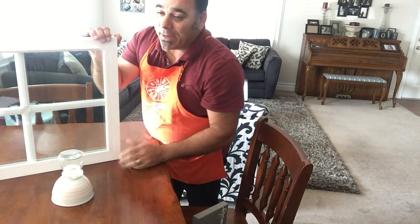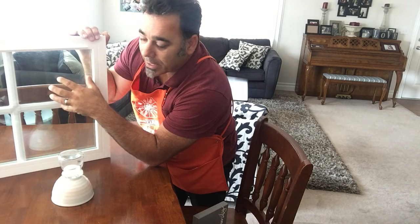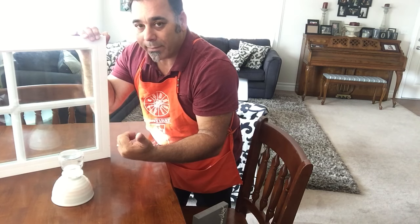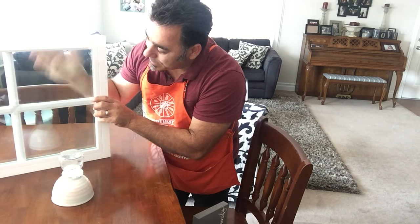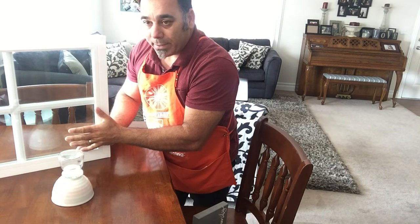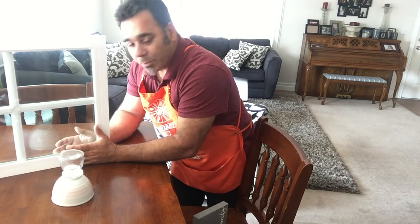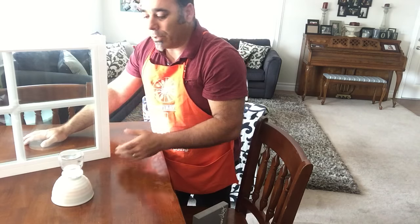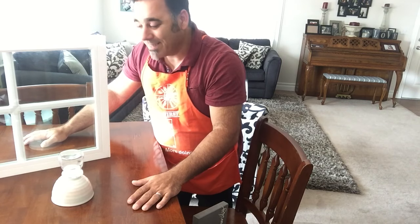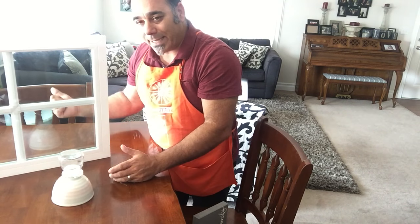Your Simonton 6500 has not only dual pane glass, but it's got a coating called low-E, which stands for low emissivity. What that does is it keeps the heat from coming in by deflecting it away while still letting the sunlight in, so you can still see right through it. It reflects the heat back away from the house. That film is put on the outside pane — the outside piece of glass on the sash — it's sprayed on. It's actually what they call a silver oxide, so it's kind of the same thing they use to make a mirror, but it's just a very light coat. If you put coat over coat over coat, you would actually create a mirror effect and you wouldn't be able to see through it. That's one of the things done to help your energy efficiency, which is why the heat was not penetrating through — it was actually deflecting away from the window.